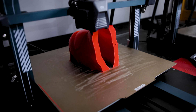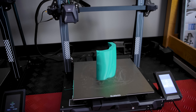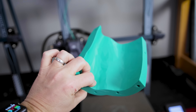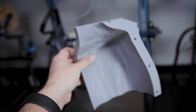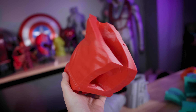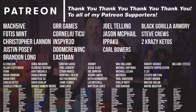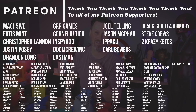I've been printing off parts for the better part of the past week across a variety of Elegoo Neptune machines. For most of these printers I now have 0.6 millimeter nozzles installed, which helps speed up the printing process and makes parts a little beefier versus a 0.4 millimeter nozzle. I'm printing everything at a 0.28 millimeter layer height, and I'm using all of my PrusaSlicer profiles that you can find over on my Patreon. A big thank you to all my Patreon supporters for your continued support.